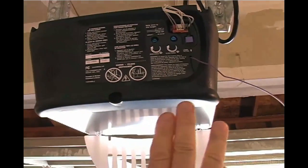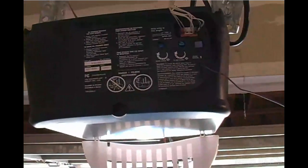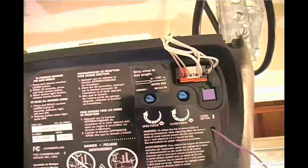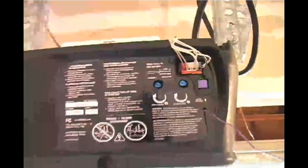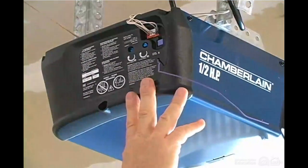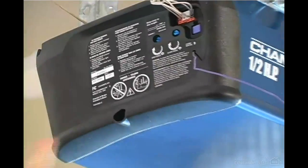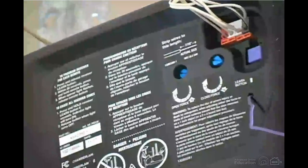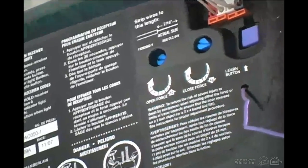This adjustment is just about right. The slot is pointing to about 5 o'clock. If it's pointing to 7 o'clock or 8 o'clock, that's too much resistance and it should be readjusted. Sometimes this adjustment screw will be covered by a light cover, and you'll have to take that cover off in order to see the setting of the adjustment screw.